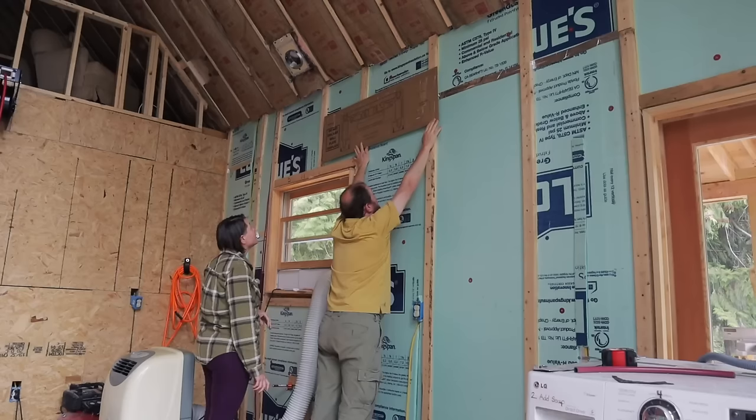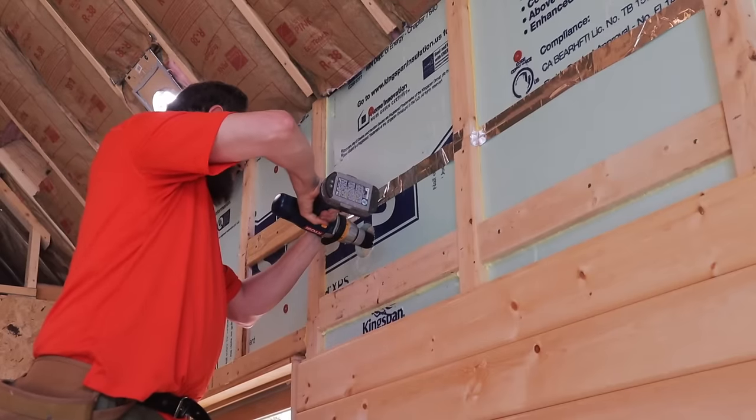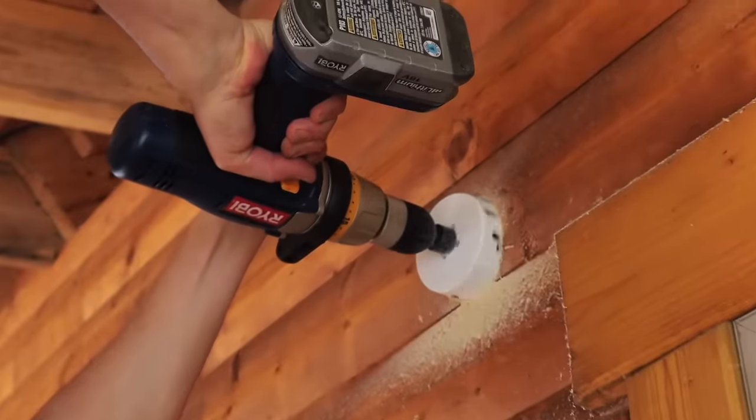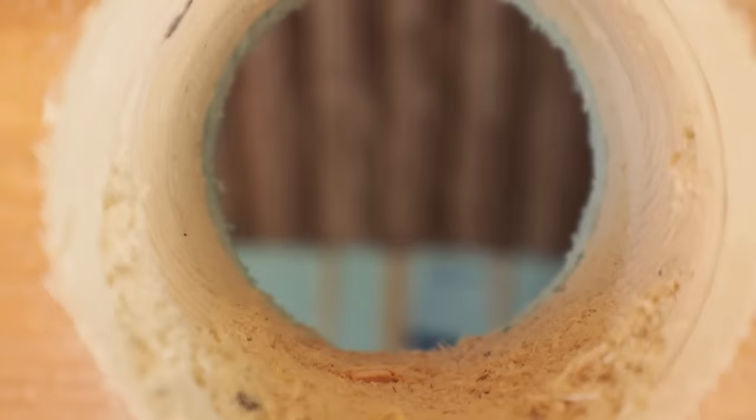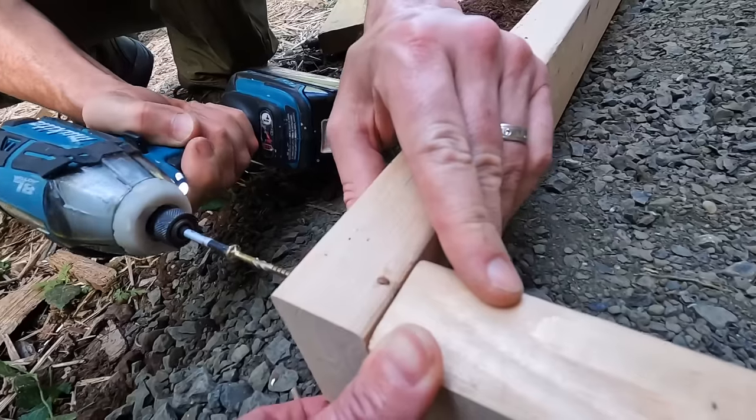Yeah, and one of the cool things about their installation is the line sets come all pre-charged. And we kind of think we can get this all installed, both units, in 1 week, which is really fast for us. You saw this earlier where we were using the template that Mr. Cool supplies to line up where the line set was going to go through the wall, and we drilled that hole out so that we had a location to pass the electronics and that line set through the wall to the outside. And yesterday we actually put together the forms where this outside unit will sit on a concrete pad.